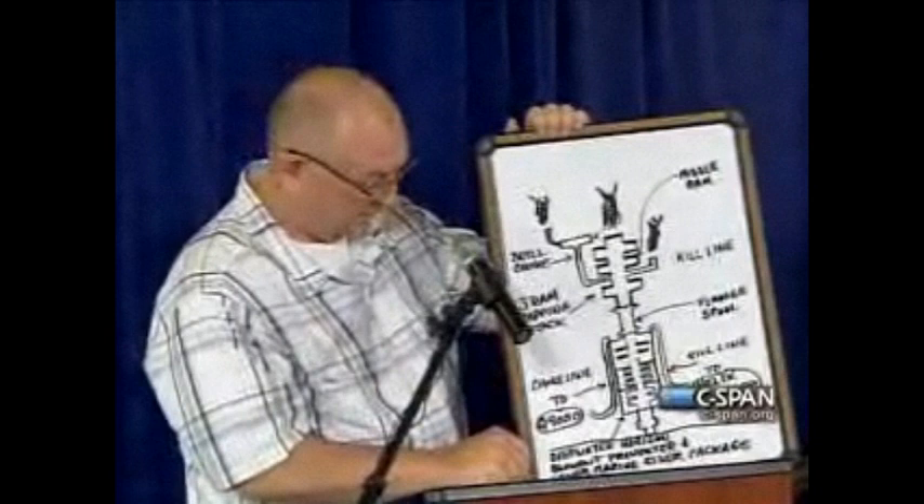Part of the reason you stopped to look at everything was the condition of the wellbore and the casing. Can you elaborate? Well, that's the issue — we don't know. We have people postulating: what if we increase the pressure to over 8,000 pounds per square inch at the top and we inadvertently cause a breach in the wellbore? We asked BP to come back and state what were the engineering margins built into the casings and the way they connect the casings together — what they call the foot and the shoes — and what kind of pressure would it take to cause a problem with those. They answered that set of questions, and then we looked at the implications of hydrocarbons or oil getting into the formation in and around the wellbore itself.